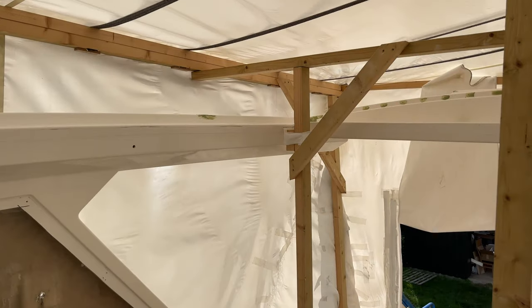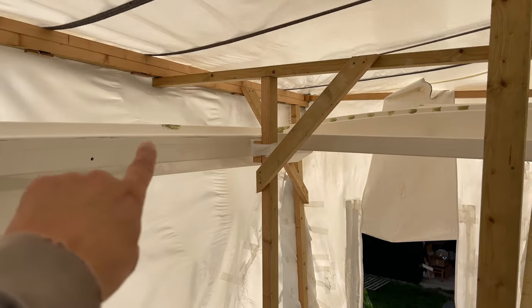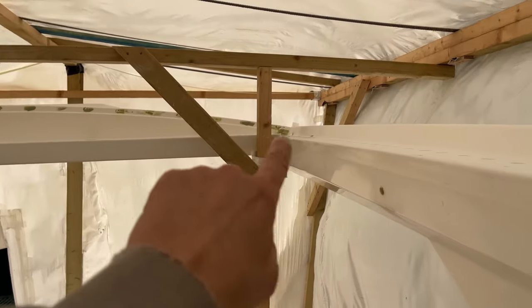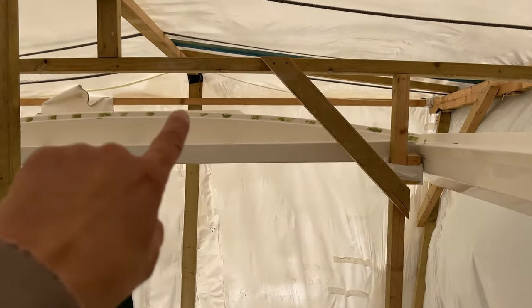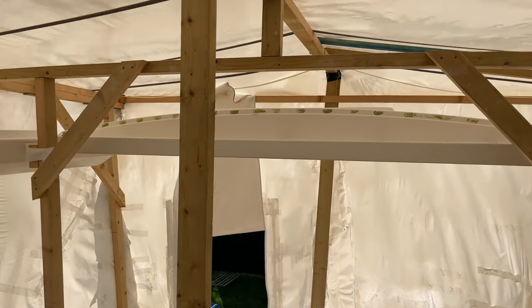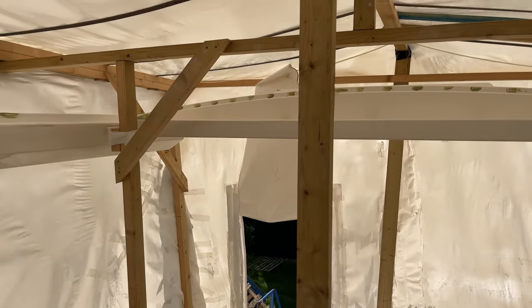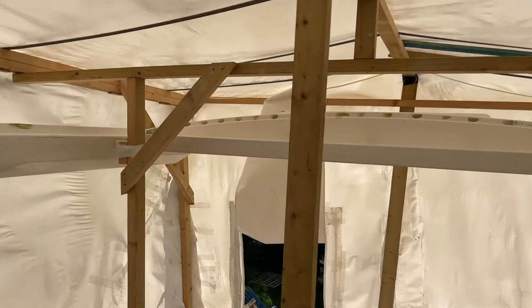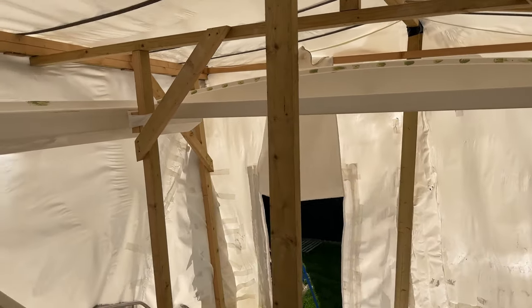Okay, working back on this top moulding today, so we've left the filler to set up. We had a chip here, and then we've got some little imperfections down here, pinholes and little bits down the bottom there, and in the end we also decided to fill all of the holes going across the top here that we fixed the canopy track to, so we'll fit a new track with fresh holes. And there's also a little bit down here, so we need to get all of that sanded, and then once that's sanded we'll give everything a clean, and then we are masking up for primer.